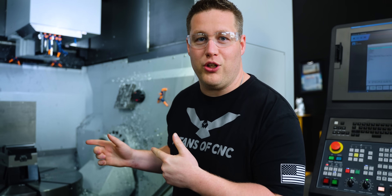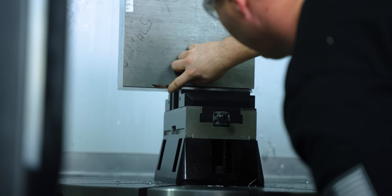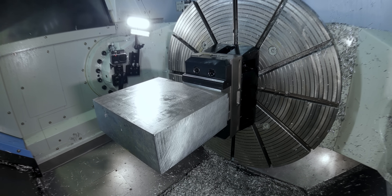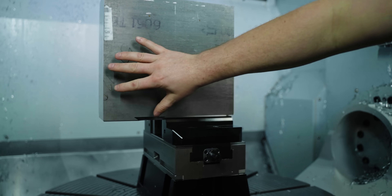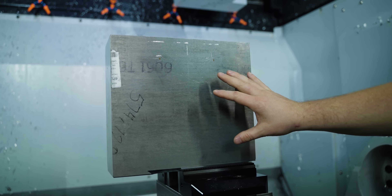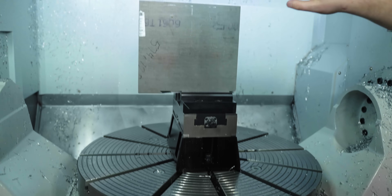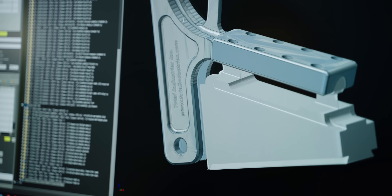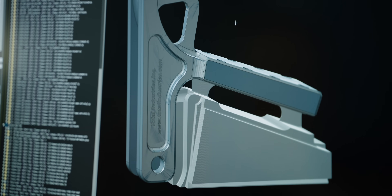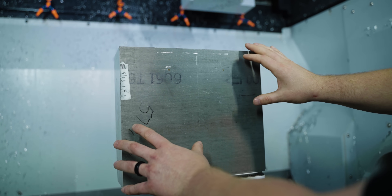Check out how we're going to hold this part. Notice that we've got a massive dovetail on the bottom and the part is just hanging out here in the space. We did that for a couple of reasons. Number one is a clearance issue — I wanted to take this stock and seat it all the way down in the vice, but the table is so large and the spindle has to come down so far that the spindle was actually going to hit the top of the table, because our part goes all the way down to right above where the vice is.